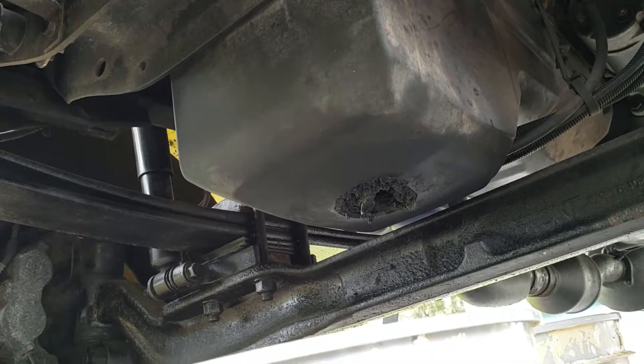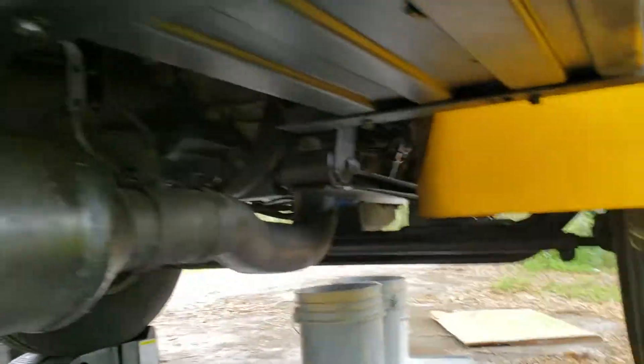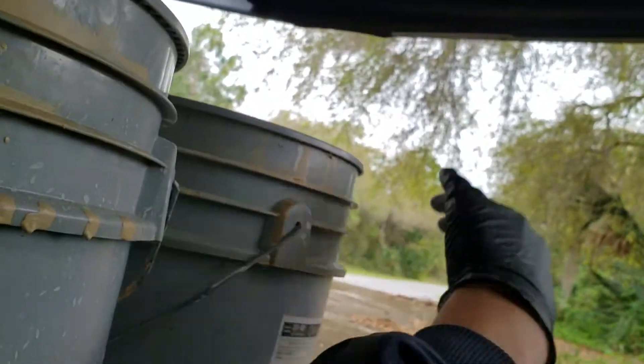It's a smaller motor so it has a little bit less oil in it. Your oil filter — if you go from the back you can see that blue stuff right there, that's your oil filter. You can probably get to it from here or if you go underneath the truck. I usually get to it right from where I'm draining the oil underneath the truck. That's my filter right there — it's long. Any automotive store will show you the part numbers for these things. That's the pan and that's the filter.